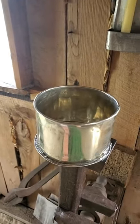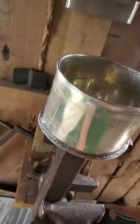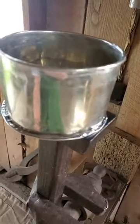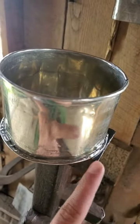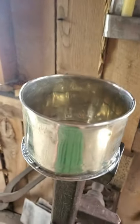I am making nine of these big cups. I'm working on putting the bottom on, so I've got this last spot right here to fold over with the metal hammer, which usually wouldn't be used, mainly because tin is such a soft metal. You can't use a heavy metal hammer on the tin — it will strip it off and expose the iron or the steel underneath, and the tin is there to keep it from rusting, so that's kind of negating the process.